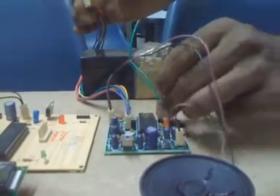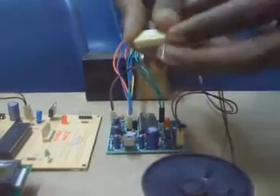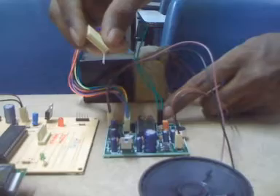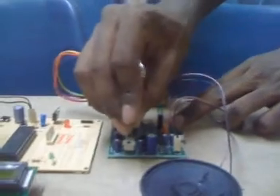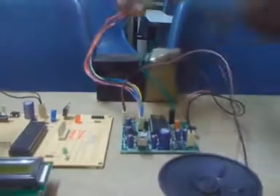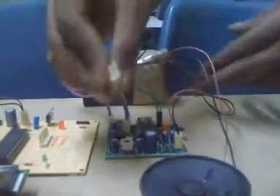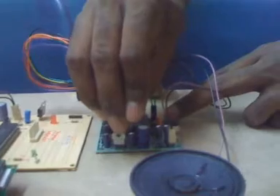Now I will empty each of the slots and record one to eight. Starting with the first slot — the two pins are shorted, meaning it is in record mode. I connect to ground, hear the beep, and record: 'One.' This is the second one. In the second slot I place the jumper and connect it to ground. I record it as 'Two.'